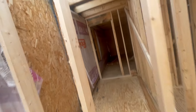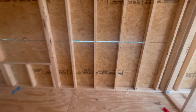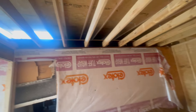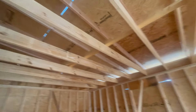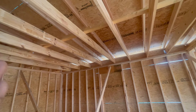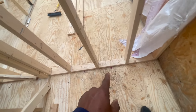We're trying to reuse lumber right here. This looks like the master bedroom — I don't really like those gaps like that, so we have to figure out a way to fill this. Did you see these spans? I had to do my little span chart on this to make sure I had my spans right. I think we're on 24 inches on center and these are two-by-eights. When we check the span, it actually works out.